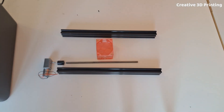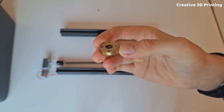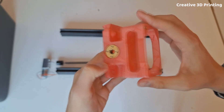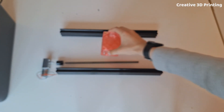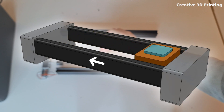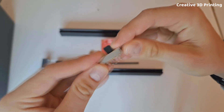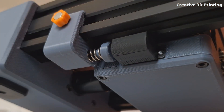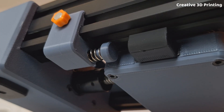There will be a threaded rod on the motor and the nut is mounted on the carriage. This will allow the cart to move when the motor is rotating. I want the cart to automatically reverse direction when it reaches the end of its path. I do this by using a double pole switch that collides with a block at the two ends — the block will switch the switch and turn the motor in the other direction.